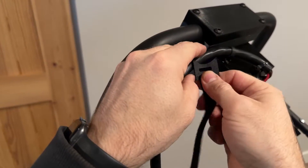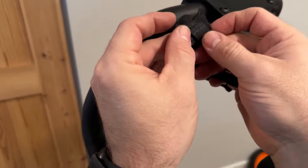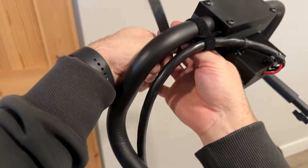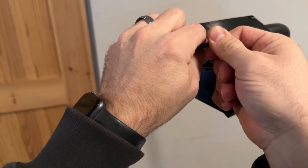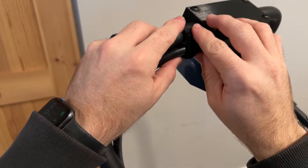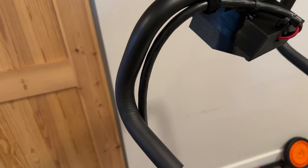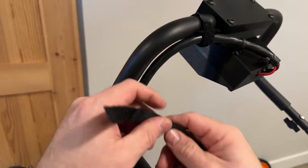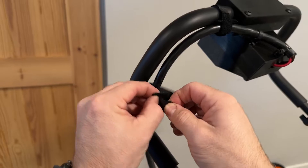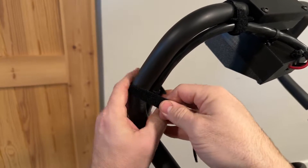There is a little trick to installing these. The first thing you want to do is actually go around the wire itself and thread it through this little slot on the tab — that way whenever you try to wrap it, it won't spin. Then you just basically wrap it around and it latches onto itself. I usually start one right by the box there, and then the next one goes right about here. That's nice and tight.